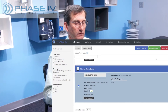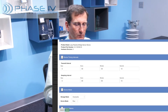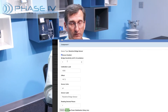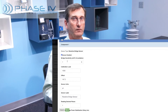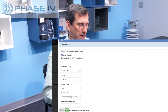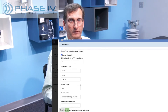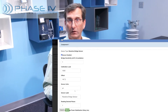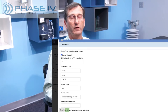To make adjustments to this wireless transceiver node, we click on the unit, press Configure, and go to Edit Configuration. There's some basic settings at the top where we can change the transmit and sample interval. Scrolling down, we get into the configuration for the strain sensor itself. We have a bridge sensitivity of 1.0 — it's a full bridge, but two of the resistors are compensation resistors and not attached, giving us a sensitivity of 1.0 at 1000 microstrain. Here is our offset of 147.2, which takes out the residual strain after spot welding on the metal. The sensor unit is microstrain; if this were a load cell, we could change that to pounds or newtons of force. At the bottom, you can set the number of decimal places displayed with the strain reading.